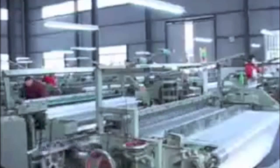But not that kind of fiber. The kind of fiber we are talking about is made from a mixture of silica and other materials, such as recycled glass. This mixture is heated and extruded into fine strands. These strands are then collected into bundles called rovings. Fiberglass rovings can either be used to directly create a product, or can be woven into fabrics to suit other applications.